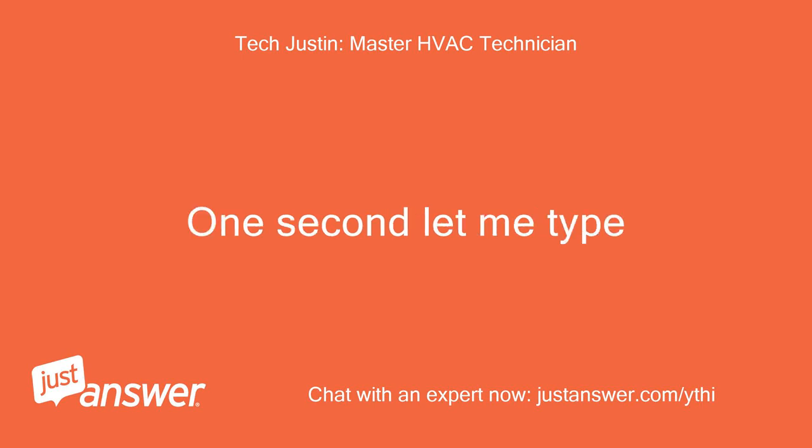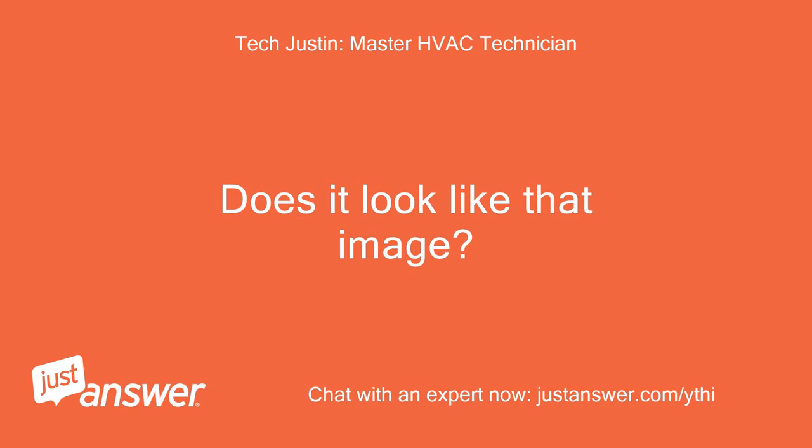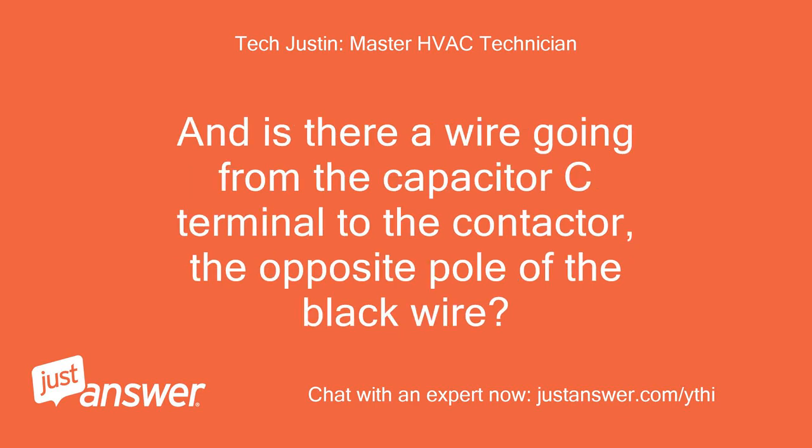One second, let me type. Full size image. Does it look like that image? They may be on opposite sides, but the black wire should be on the same side as the contactor wire on the opposite pole. And is there a wire going from the capacitor C terminal to the contactor, the opposite pole of the black wire?